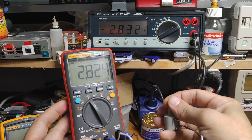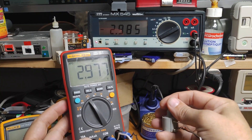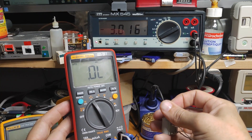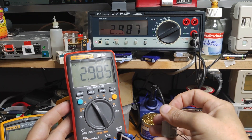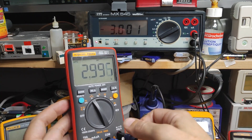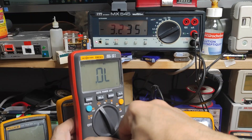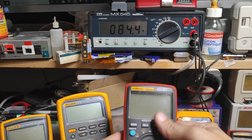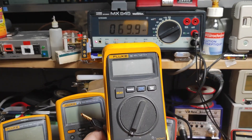Let's see how far it can go. At 3 volts it cuts — you cannot see more than 3 volts. The probing voltage is about 3.2 volts, which is actually very nice for a multimeter in this price range.